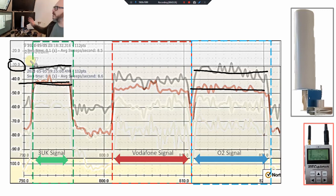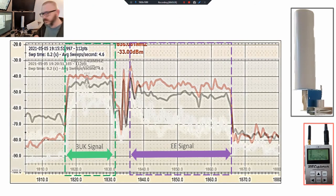When you average the measurements across all the scans, the gain of the antenna works out to about 11 dBi - not a bad result. But you have to take into account the cable, because when you use this as a product you'd be plugging the antenna port into your router. When you consider the whole product, the actual gain works out to about 6.5 dBi over the stub antenna. That's the true gain in signal strength you would get. Moving on to the mid band, the results aren't quite as good.